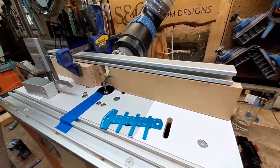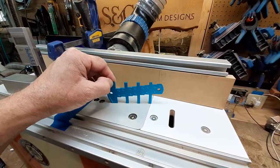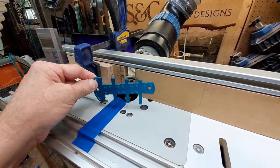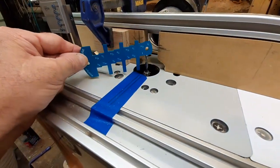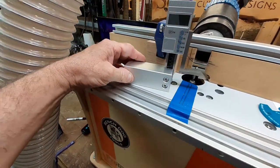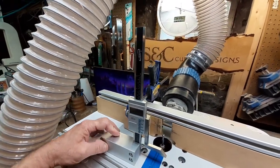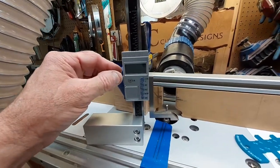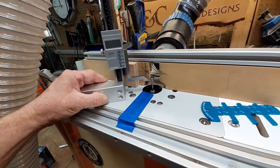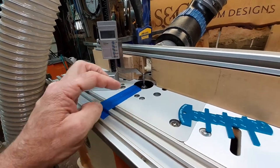When you're trying to gauge how deep it is, you could use a jig like this — this is the router depth gauge. I'm not sure where I got it, if it was from Rockler; I have a lot of items from Rockler. You just set it down like so and then you can gauge. There's also this magnetic unit on the base — it's from iGaging. This is great because it's digital. I have it set to one and one-eighth inches. I actually went a little bit higher since you want your mortise not to be snug against the base where it's going to sit.